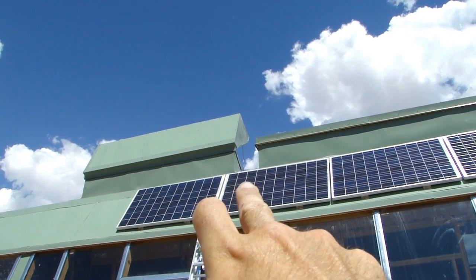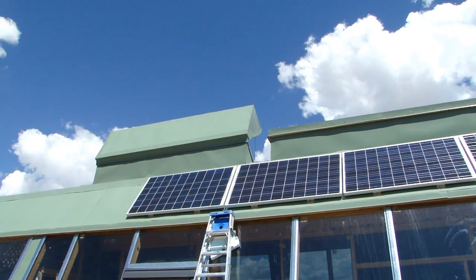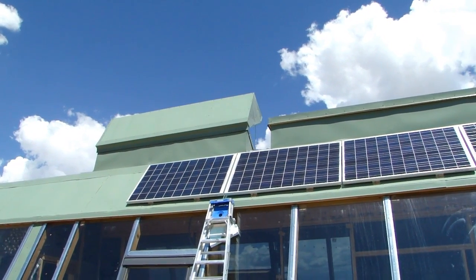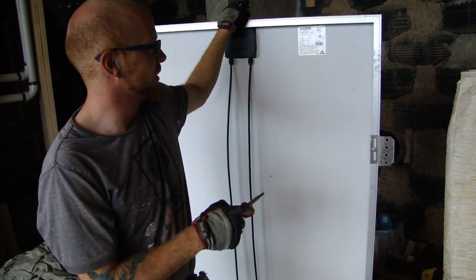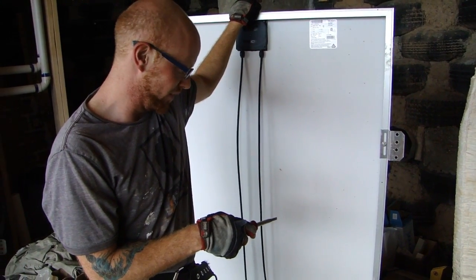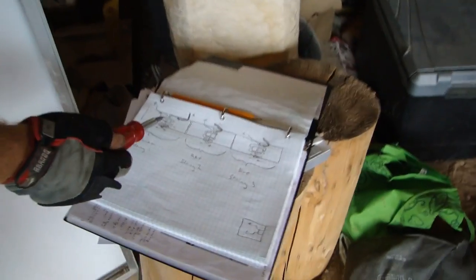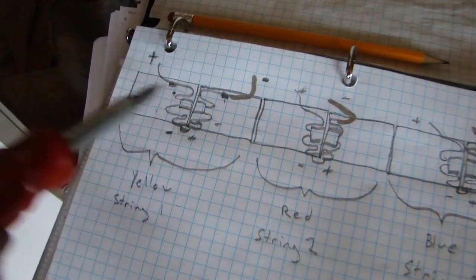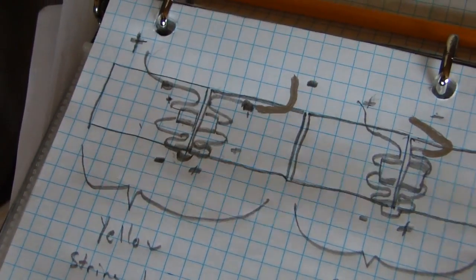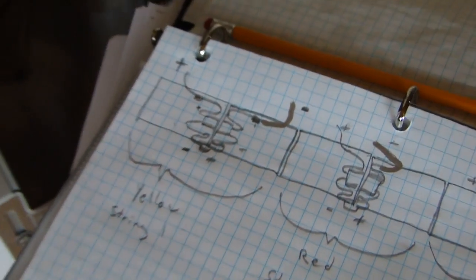The negative and the positive of those two run in two separate cables into the systems box, into the combiner box, into another breaker. We're going to do some wire harnessing right now so that when Dan goes to put all these modules on his roof, he won't be cursing and screaming trying to connect them. We drew a little diagram of how all the leads coming out of the modules are going to connect to each other and connect to home runs — a positive and a negative. It's basically three strings of two modules connected in series, and those three strings are run in parallel to a combiner box, which combines the load into one bigger load.